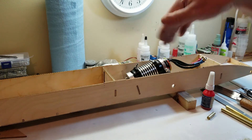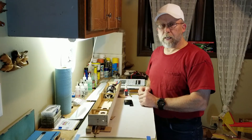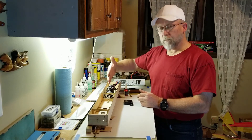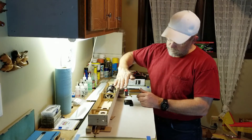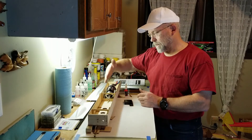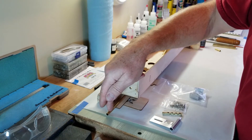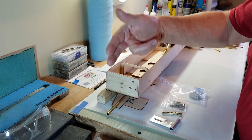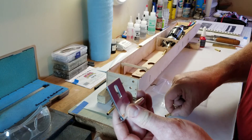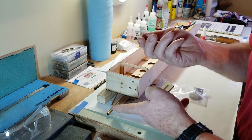Epoxy this piece of tube, then pull the motor, pull the stuffing tube, and seal the hole inside the tub. This might seem like a bit much doing all this mock-up, but I saw pretty quickly when I was getting ready to epoxy this motor mount in that I had to look at some things. That's just how I like to build - not guessing, not painting myself in a corner. With the quarter-inch diameter OD stuffing tube, I'll be running a 3/16 flex cable with no Teflon liner. I'm going with the Speedmaster 21 strut with their brass bushing with the grease holes that is free to rotate inside the stuffing tube.